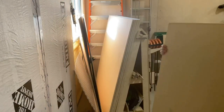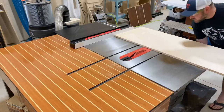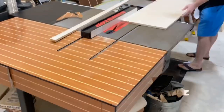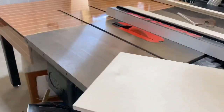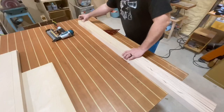Okay guys, thanks for joining me. Let's get this thing started. Got off work, going to make a one-afternoon and evening build. This is the tabletop you're seeing me cut right there. Then I'm going to take this Baltic Birch, three-quarters of an inch in thickness, and run it through the table saw making a bunch of two-and-a-half inch strips, because I'm going to layer those to make the two-and-a-half inch legs.